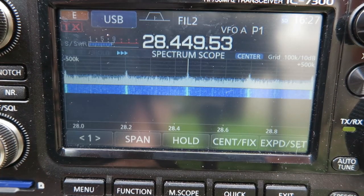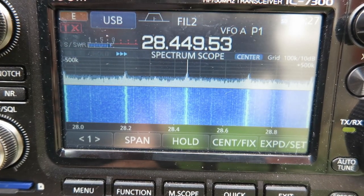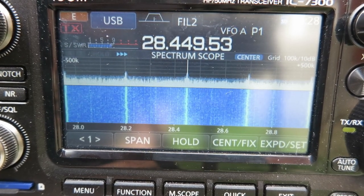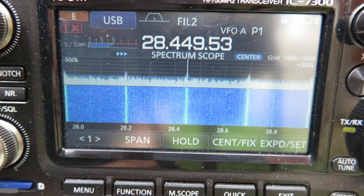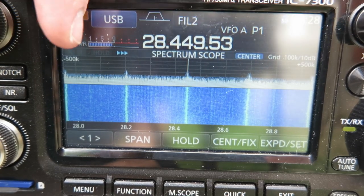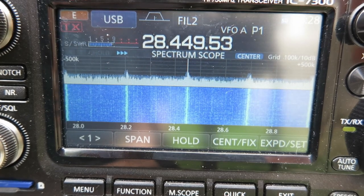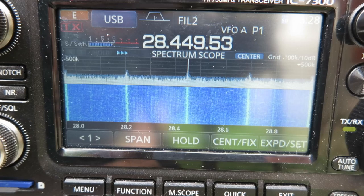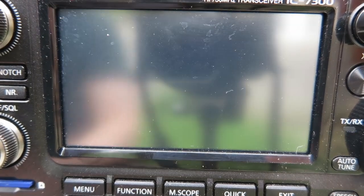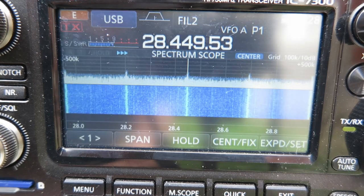Looking at a wide view of the spectrum with the Radio Shack supply, there are frequency combs spaced about every 250 kilohertz across the one megahertz span — I see them at 250, 500, 750, and one megahertz. I don't think that's from one of these power supplies — it could be a supply somewhere else in the neighborhood but it's not one of mine. Going back to the battery, those combs are still there, so it's not me.